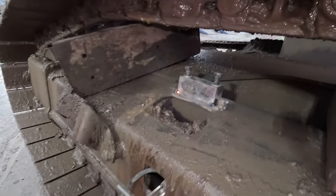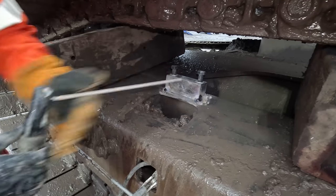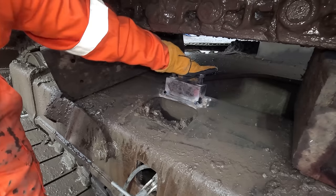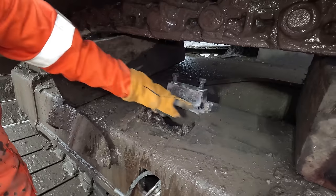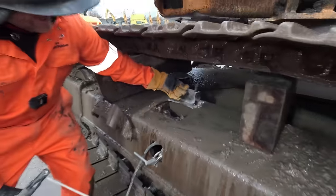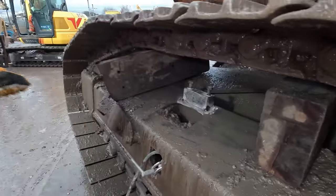So what I'm going to do now, I'm going to put just a little stitch at the back, and then we'll weld the front. If you wasn't to put anything on the back, if them tacks were weak at the back side there, you put a weld on there, and it'd crack them tacks and pull it this way. It'll always pull towards where the heat is.